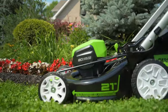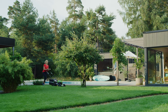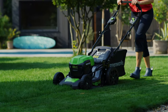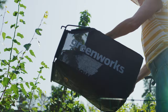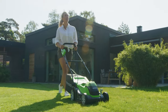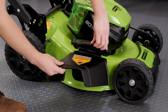There are a variety of reasons to use the grass catcher. Bagging grass is an option often favored if your grass has become overgrown. While those long grass clippings are full of nutrients, they can tend to smother the healthy grass underneath. There are also a variety of other benefits to bagging grass, such as less mess and reduced allergy symptoms. When using the grass catcher, the mulch plug and side discharge chute must be removed.